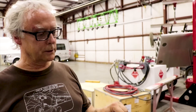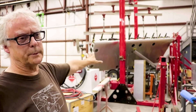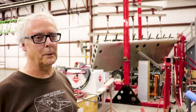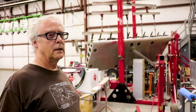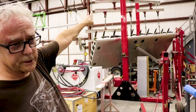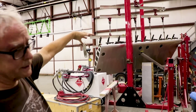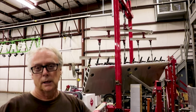So what have you stressed your wing to on this contraption — this medieval contraption? Well, they didn't have hydraulics like this back then. This is a digital readout setup. That wing in there has been cycled — oh gosh, we lost count how many times we've taken it to nine G's, so it's been up and down a lot. It's called a wiffle tree in the business, where you start out with a single point of force application and a load cell — that little S-shaped thing up there. It comes down like a big mobile and picks up about 40 or so attach points on your wing, so you can simulate as best as possible the air loads on the structure.